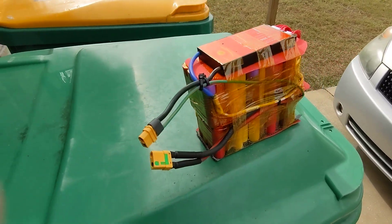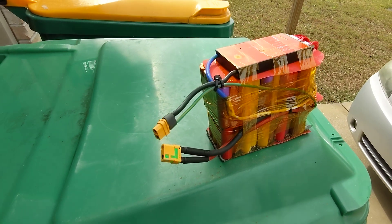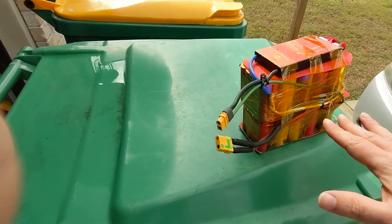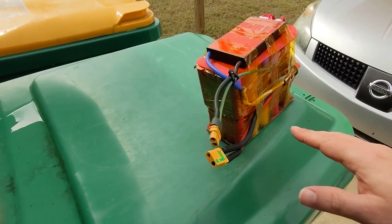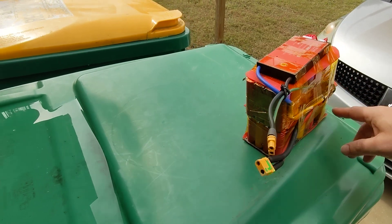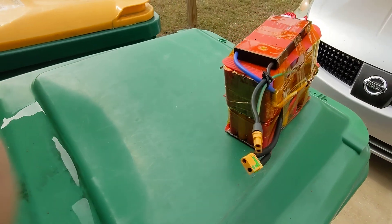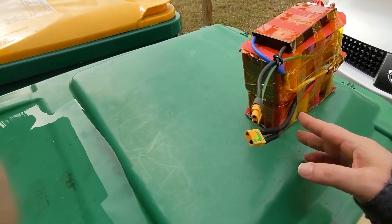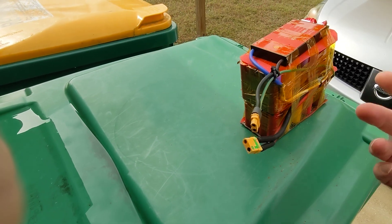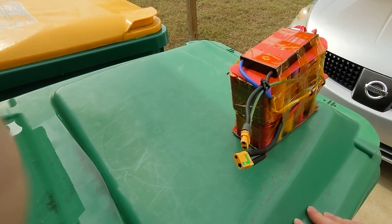What I'm going to do now is I bought 120 cells brand new, and these are high amperage. So I'm going to redo this battery, obviously make it look prettier. It'll be six in parallel instead of four, and then 20 in series, so that'll give me a little bit more capacity. They're also 21700s, so they're a little bit bigger and will have a good amount of capacity. But I really care more about the amperage.